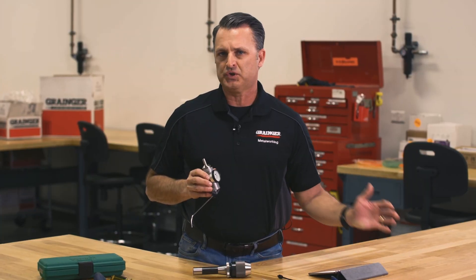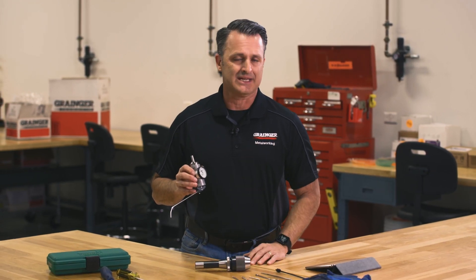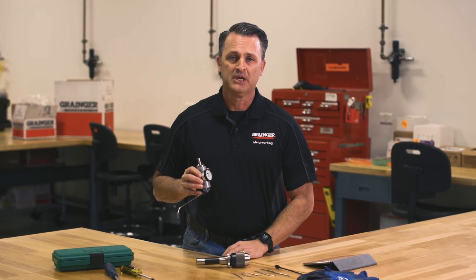The spindle of a manual mill is used in various orientations depending upon the job, so tramming the machine head is something that gets done or should be done fairly often. Using a simple device like this will make that easier and faster and obviously keep the machine in a better orientation for its use. Repeat the process as often as is necessary.